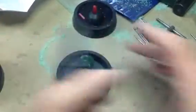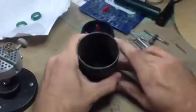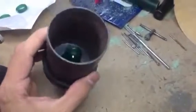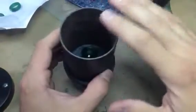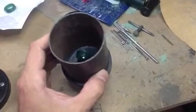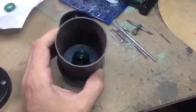We're going to go ahead — what happens from there is we take this metal flask, the cylinder, and we seat it right in the rubber boot. If you look inside there, that's going to be where my wax ring is going to be. We're going to fill this up with what is called investment, which is kind of like a plaster material. You mix it with water, it's white, and it hardens in about two hours, and you pop it in the kiln for a burnout.